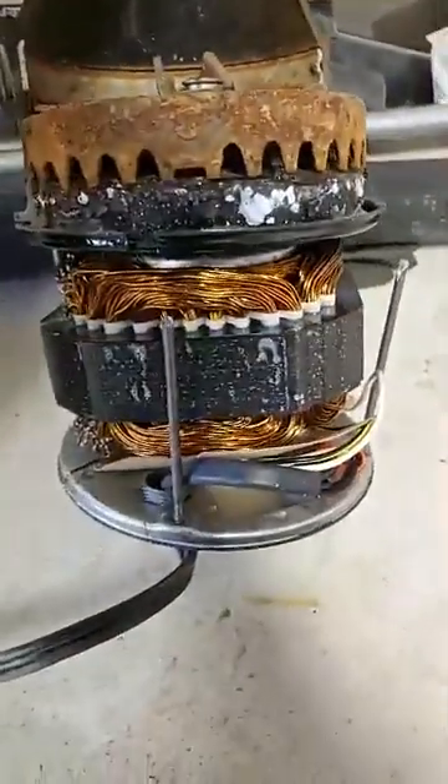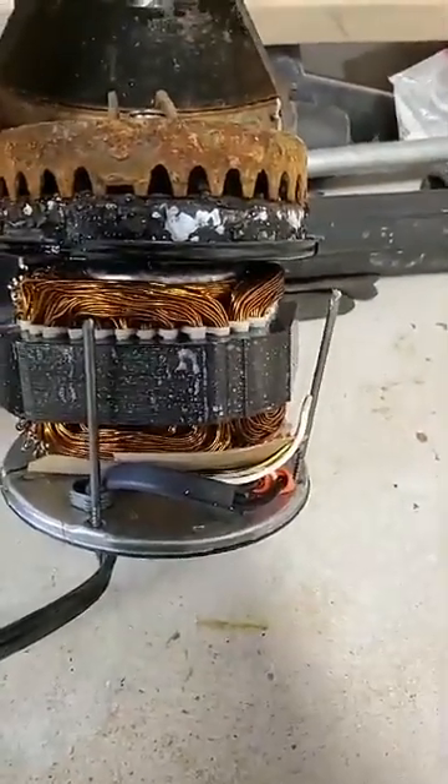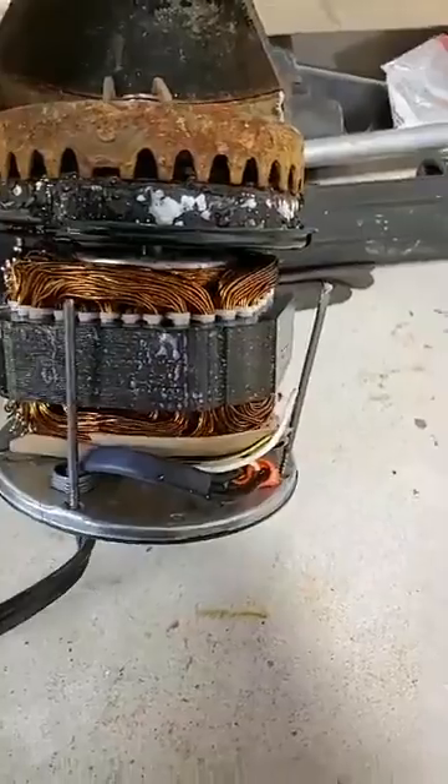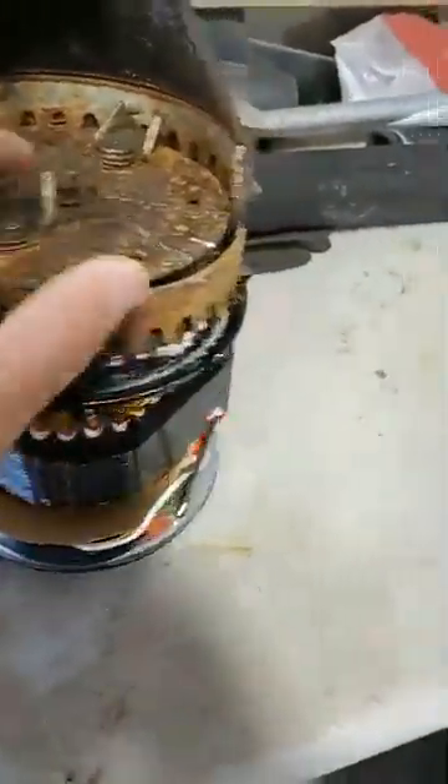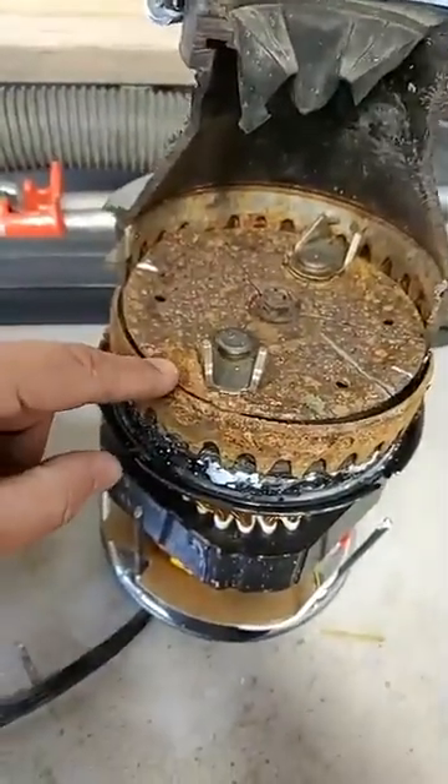That's an electromagnetic magnet, and basically that's the motor. What happens is the electrical current goes into that motor and it spins it. And as it spins — all activated by your switch — it moves this rotor here on top, spinning these blades, which pushes everything into these teeth, which grinds it up and eventually sends it on out.